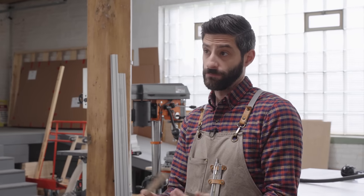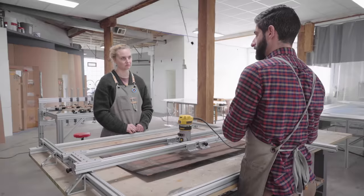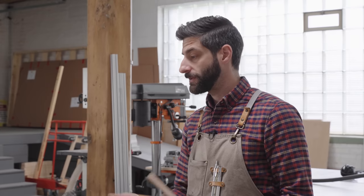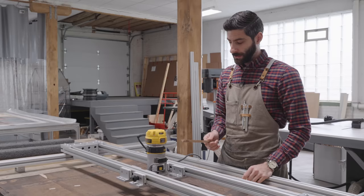We're not taking this lightly — removing wood, adding wood, using an epoxy — these are not our first-choice decisions. We run through all other options, and when we can't find options that are suitable, then we come to these. I want an incredibly strong and incredibly rigid glue joint, and for that I'm using a two-part epoxy. If it ever needs to be removed, just like paintings in museums that have inlays, those will have to be removed manually.